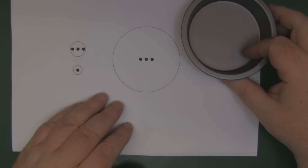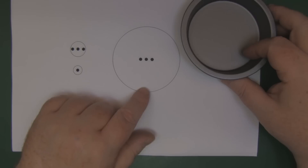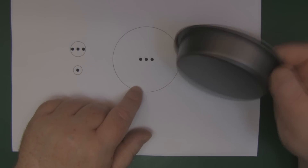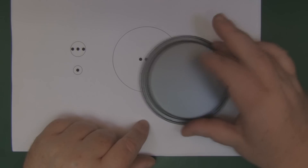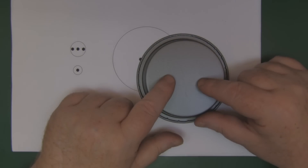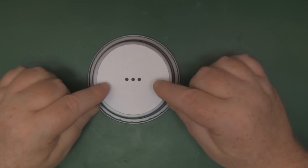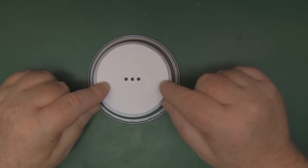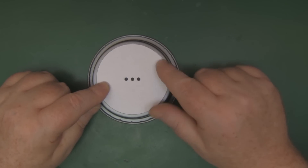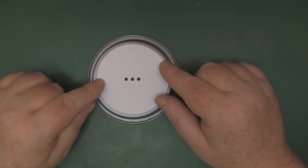To make things a little bit easier, just like in the 2.4GHz version, I've made this template for the two parasitic elements. I'm going to cut the larger one out, stick it to the underside of the tin, and that will give us a guide to help drill the holes in the correct positions. Even if you don't find a tin the exact same size, the template makes it much easier to centre and line up the drilling holes correctly.